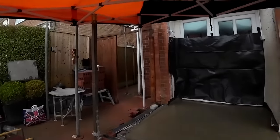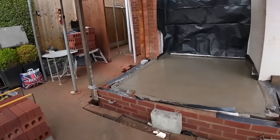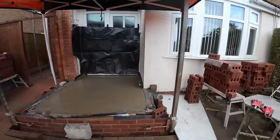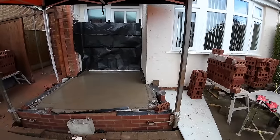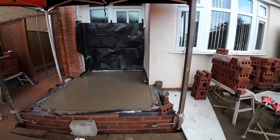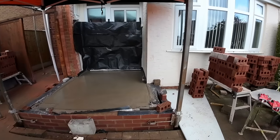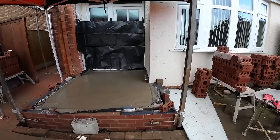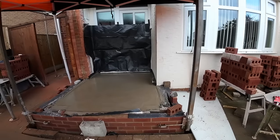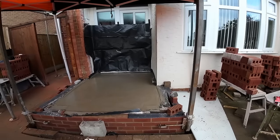We've still got patching to do up on the scaff, but I want to concentrate on brickwork. I need to get concentrated on this while Alex is with me. Still got to put this cut in with the MX saw, but I don't want to turn the slab red. But once it's dry, you can sweep it off then, can't you? No, the cut's got to go in before the brickwork starts. You can't cut it behind the brick. Oh no. It's got to go in before the brickwork.